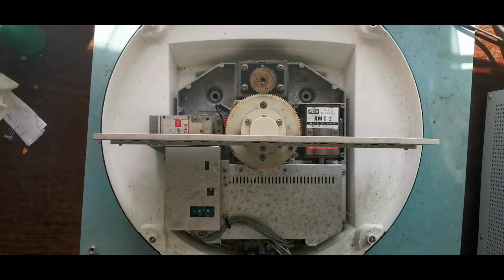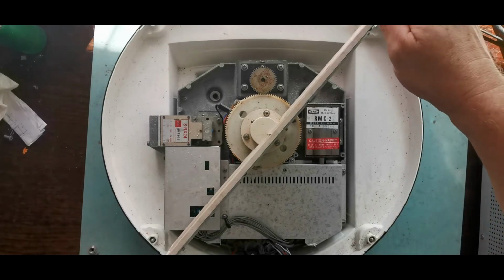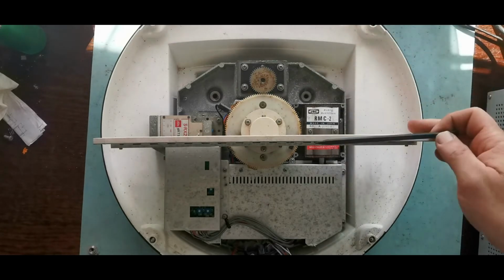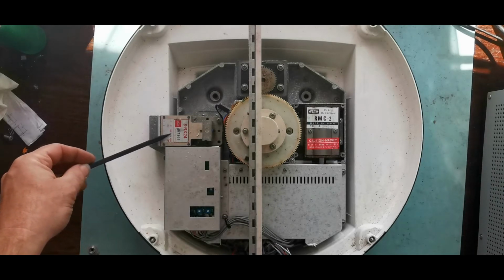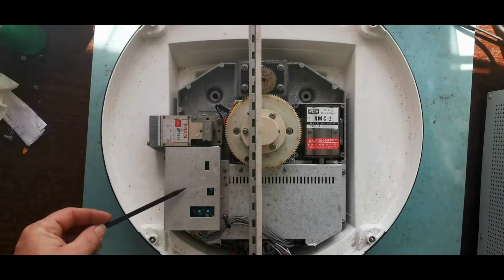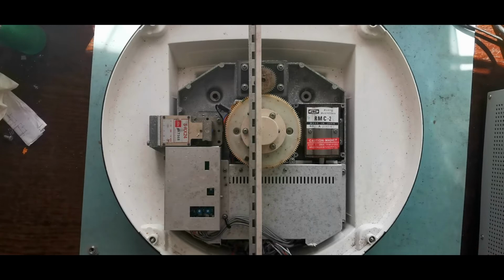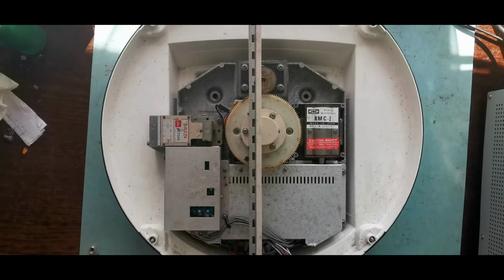We do need to take a few precautions in here. There is a high voltage power supply, which, despite the fact we've got it all disconnected, we will check to make sure that that's not connected. We need to be careful around the magnetron in here because of the possibility of beryllium. Functional module wise, we have a motor and gear which spins the scanner. We have a magnetron. We have a high frequency receiver. We have the IF, and I believe that's the post-processing. And then all of the switching and high voltages are generated there.